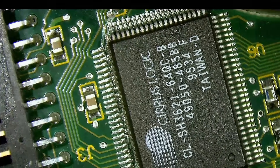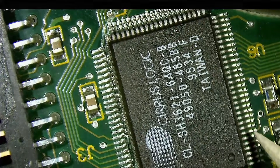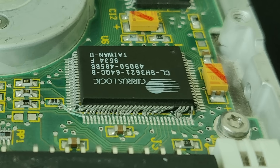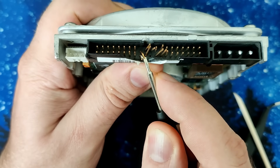While looking over the PCB, which looks so nice with all the chips and components, I found this IC with one side badly damaged. All pins on this side of the chip have been squeezed under the housing. Almost none of the pins connect to the pads anymore. But those are all the damages I could find. What do you think — is this drive too far gone?